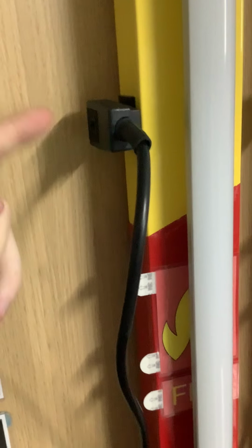Okay, so the cords just unplug. They're computer cables, and I use the side plugs because of the gap. The standard ones with the normal top entry would protrude too much and it wouldn't be able to get in, especially with this limited gap here. But these side ones do very good. I'll use those for these emergency battens as well.